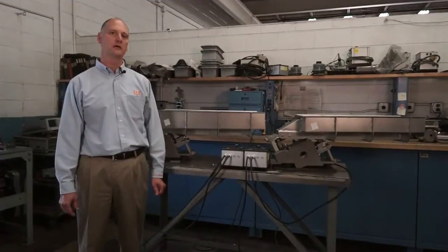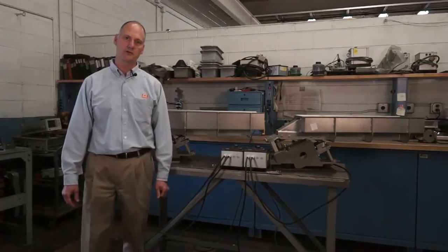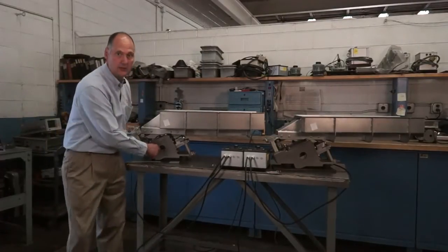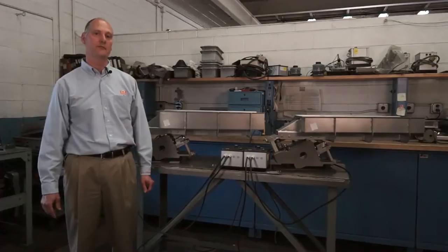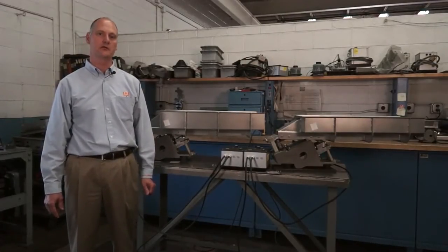When tuning a feeder, a small amount of striking — which is the impacting of the electrical assembly and the armature inside the drive — is permissible. However, it must not be allowed during regular operations since damage to the feeder can result.